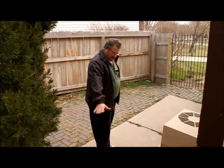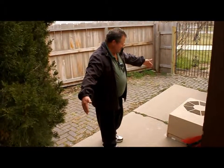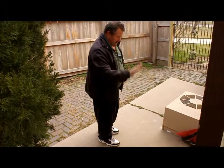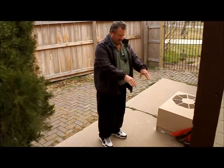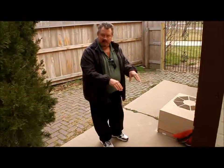The air conditioner pad slash patio step down needs to be completely broken out and re-poured. It's dropped five, six inches back toward the house, so all the rain water is continually running back and standing against the foundation. That absolutely will cause basement leaks at some point.